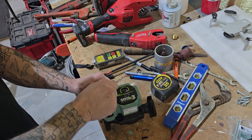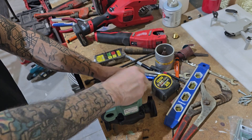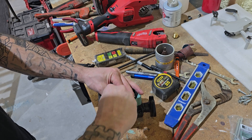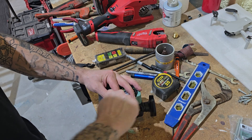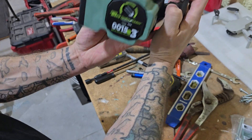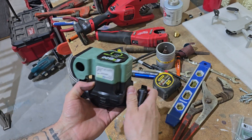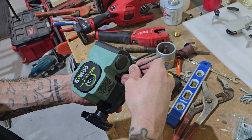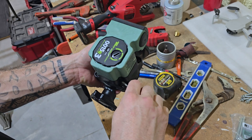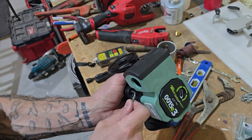Pay attention to that — read the manuals. I tell all my customers to make sure before you install anything, you're doing it to the manufacturer's specification. There are a few reasons why they don't want you mounting a pump a certain way — mainly, any time you have the motor inside, you don't want it facing down. Go ahead and put your Allen screws in and snug them up. They don't have to be super tight — don't overtighten and strip or crack the screw. That O-ring in there will keep it completely sealed; the point is not to rely on cranking these down for it to seal.